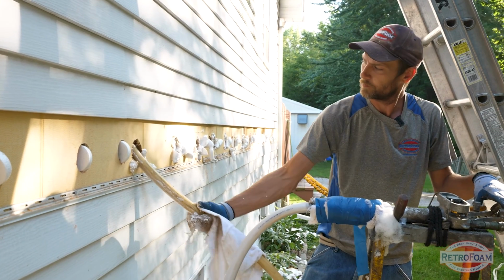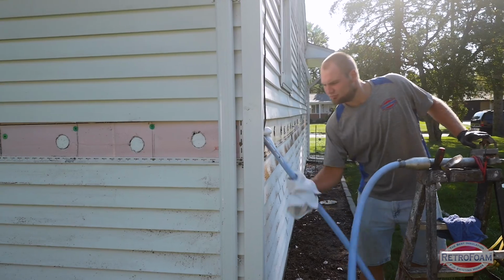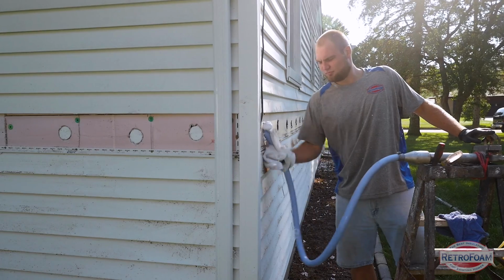This is really kind of case by case, and it's important that you have an experienced contractor out there that knows how to handle this situation, because there are sometimes that you can work with it or you can spot check around the house to make something work, where you're just filling in gaps, that sort of thing. But this is another situation where if you have foam in those walls already, there's a good chance that injection foam is not a good option.